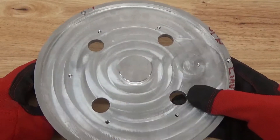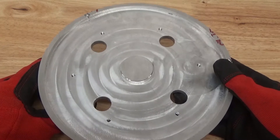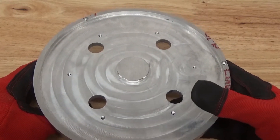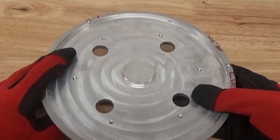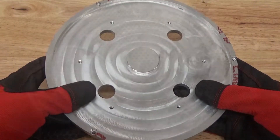Right now we have a mixture of glass bead and aluminum oxide — very fine mesh materials — and we're mixing those very well in the machine. We're going to process this part and then we'll be back after we finish blasting. So stay tuned.